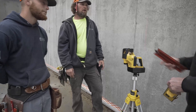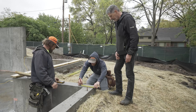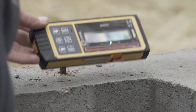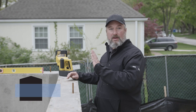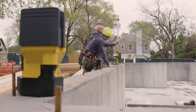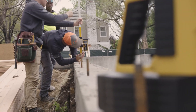This is on the tripod, but if you've got a wall and you wanted to set it right on the edge of a wall, you can do the same thing — you don't have to have it on a tripod. That point down is going to be right on your edge. Then you can run this out and put this on another edge out there and make sure that wall is square. We just got done marking out our sill plate on our tall walls. We started with going two and a half inches off the inside of our foundation wall. So this is our inside of our plate and then as far as 150 feet, we can mark our second line and then run a chalk line across it as a good reference point. You can create multiple marks and then double check everything.